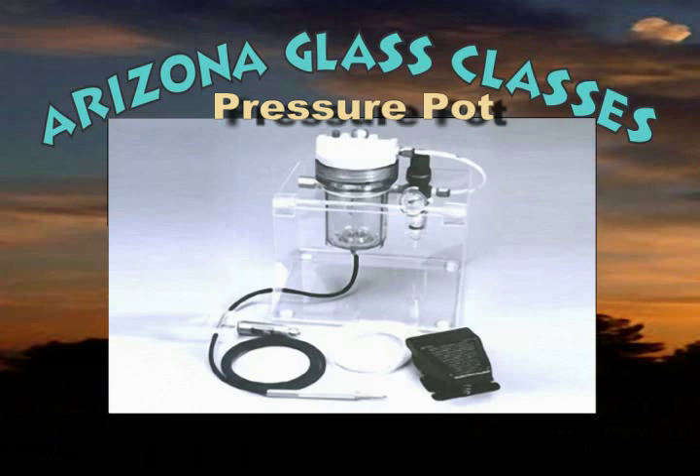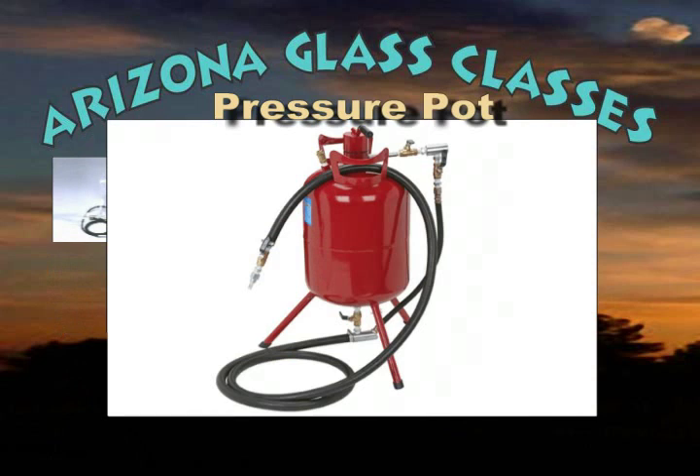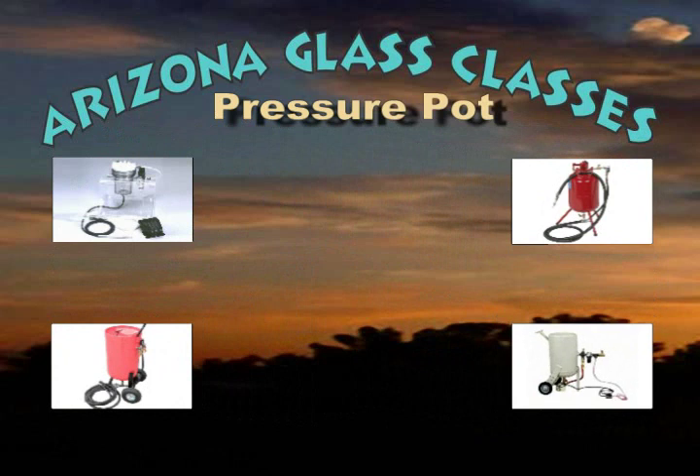Pressure pots come in a range of sizes. This is a complete pressure blaster with a foot pedal, control valve, a small pressure pot and a regulator. Designed originally for dental work, these work well for small items, single stage etching and halftones. Nozzle sizes are 1/16 of an inch and smaller. Regular pressure pots range from smaller 40-pound simple design units to 90-pound and larger units incorporating dead man valves at the nozzle or foot pedal valves to control the abrasive and air flow. Notice the last two pots displayed have a dished or concave top with the opening of the pot at the bottom of the dish. This style of pot is much easier to fill than the previously displayed red pot, which requires a funnel.